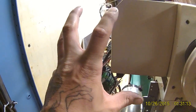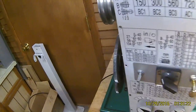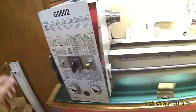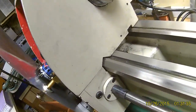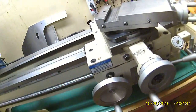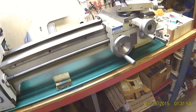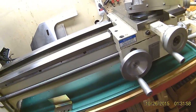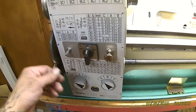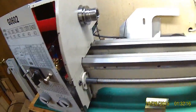I like this whole setup because once I have the other pulley back on, I'll actually have six gear ratios — although with this motor and the top gear ratio, we'll probably never touch it because it'd be spinning faster than the bearings can handle. Maybe I helped somebody, maybe I'm just barking into YouTube. I don't have a potentiometer knob yet — I'm going to turn one once I get the carriage hand-scraped well enough to make a parting cut without the lathe trying to leave the counter. I went from all that crap down to these three levers. That's all I got for today — you guys have a good night.